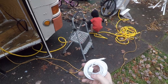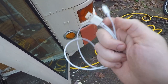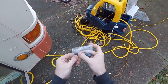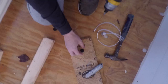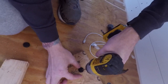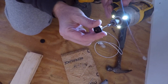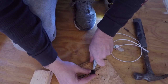The camera came with a long USB cable but I found a shorter three-foot cable on Amazon that fits, so I'm going to use that instead. I also found these rubber grommets made for a five-eighths-of-an-inch hole — these grommets don't have a hole in the middle so I can make my own hole for the camera cable. I'm using an eighth-of-an-inch drill bit to drill a hole in, then using a utility knife to cut it through.